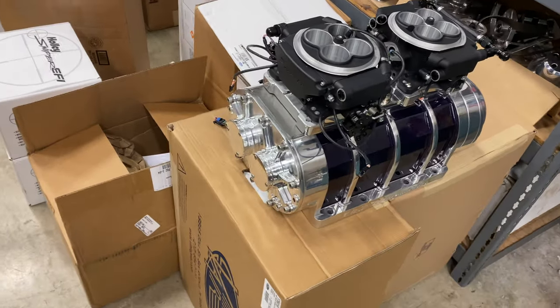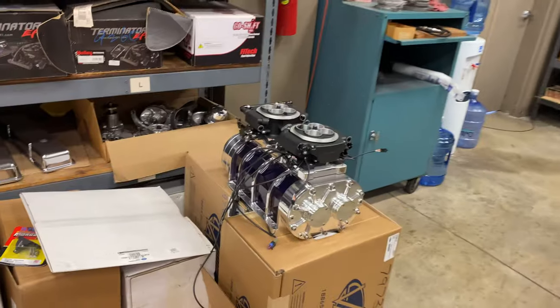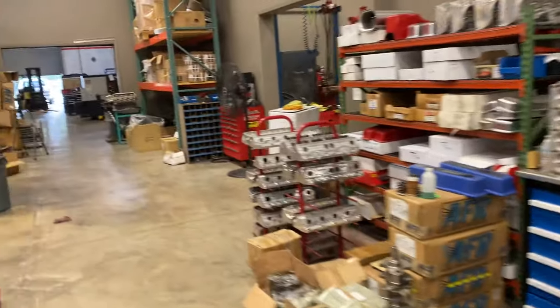Their self-tuning program is super fast and very smart, very intuitive. It's pretty cool how it works. So it has a base fuel table and then it has a second learning table. And as the O2 sensor in closed loop mode compensates for the fueling, it populates its learning graph and then multiplies that versus the base table and goes from there. And in the software, it's really cool because you can run it on our engine dyno for a while, let it populate the learning table for a little bit, and then I can flash that learning table into the base table so that way closed loop doesn't have to make as many corrections off of the base table. So really like the Holley stuff. Anyways, let's go see how Trevor's doing.